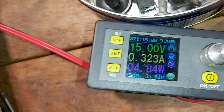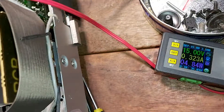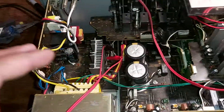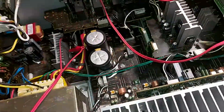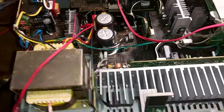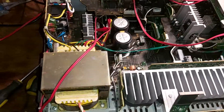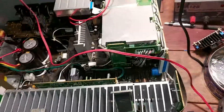This is using about five watts of power with it cranked to the max. So make sure whatever power supply we build is capable of handling at least 15 watts. This is going to the preamp so it shouldn't use too much power, but just to be safe I put in a power factor of three times. I haven't built the circuit yet, but I know what's going on.